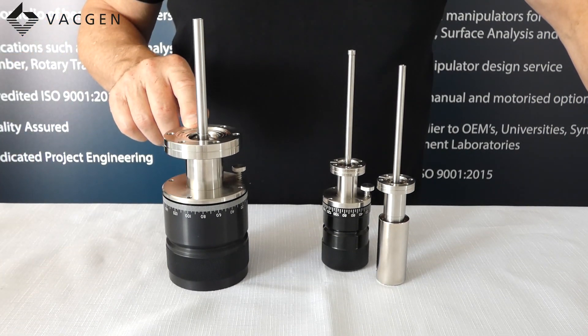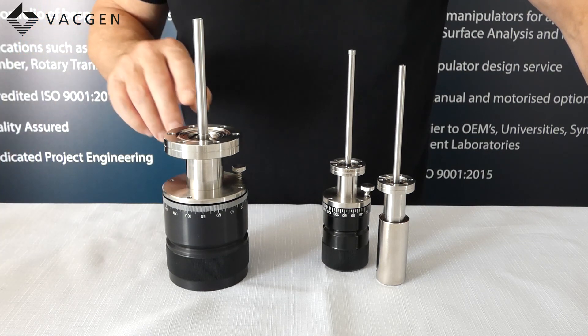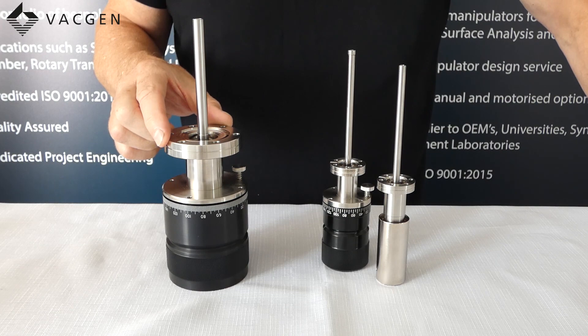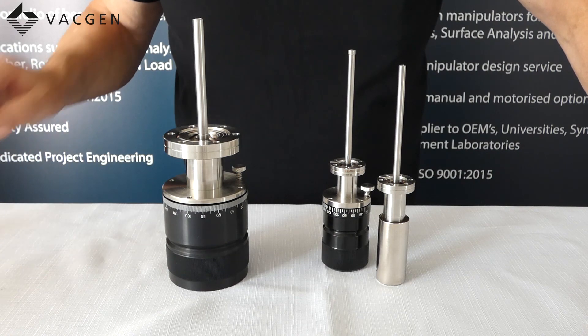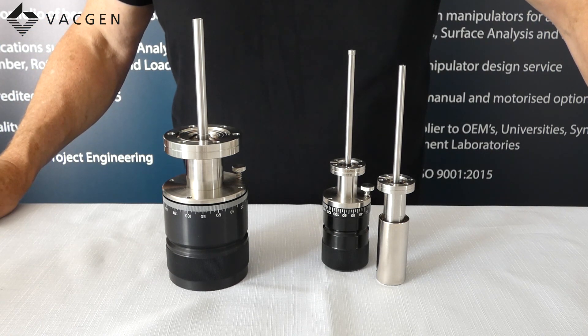The MRD-6 is a direct replacement for our RD-6 which has the bellows inside. So if you want to get rid of your bellows you can use this as a direct replacement, as it has got a 100mm shaft with a 70mm flange. This will also replace the RD-7 as well. The only thing with the RD-7 is the shaft length is 2.56 inches, but we can extend the shaft if required.